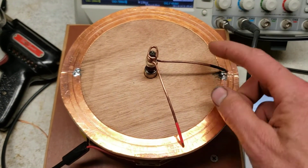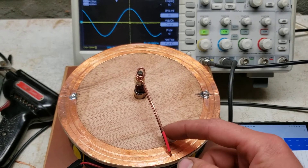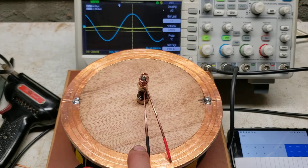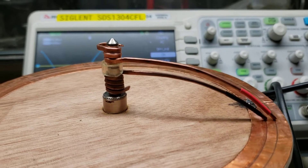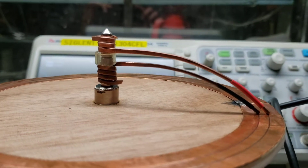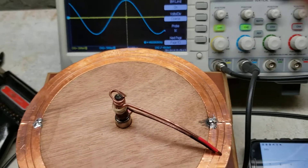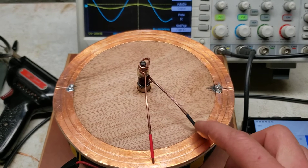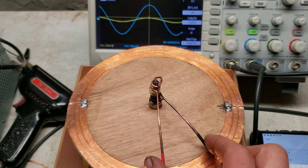This allows me to measure voltages between any two points on here, either across the resistors or across the segment of the copper winding. They run in a path at right angles to the active orientation of the magnetic field, so hopefully no magnetic field will be induced into my probes. This is a stereo jack acting as a pivot, and then it goes down through the coax to the oscilloscope. The black one is my negative lead — the shield of the coax — and the positive is the red one. We will be measuring clockwise.